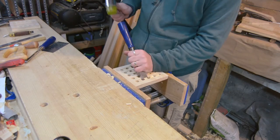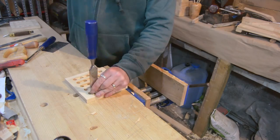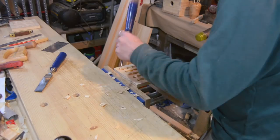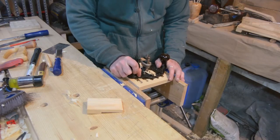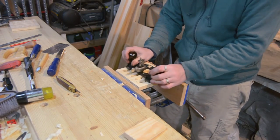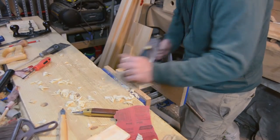This time for the grooves I went a lot slower, tapping straight down with the chisel and then clearing out the waste. Here you can see how the pattern is turned 90 degrees on the opposite side. Once I got close to the center point of the piece of wood I started using my router plane to make a smooth bottom edge to each one of those intersections. I didn't do a very good job on the walls of these dados — there was a lot of tear-out — so I did use sandpaper to sand a lot of it back.